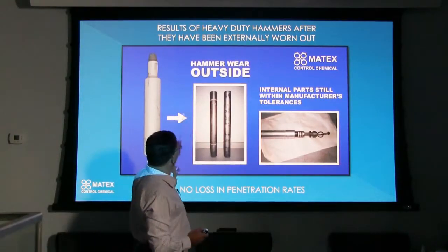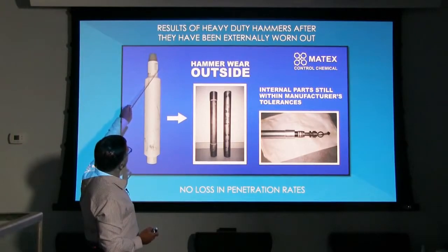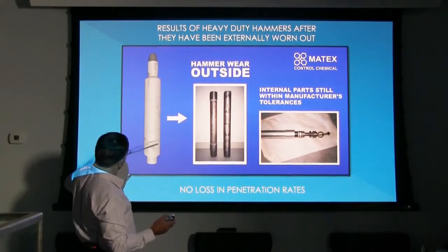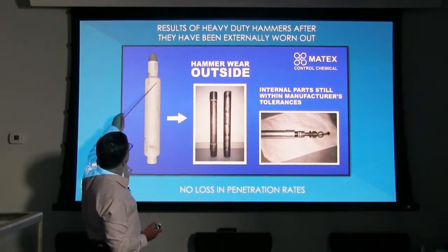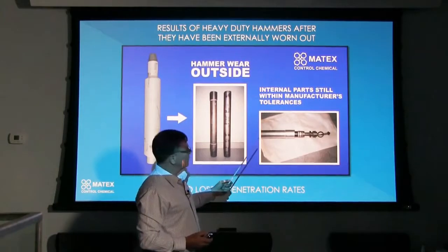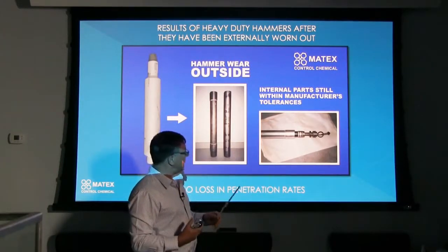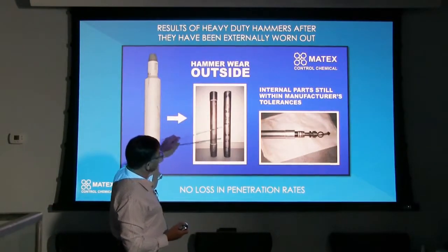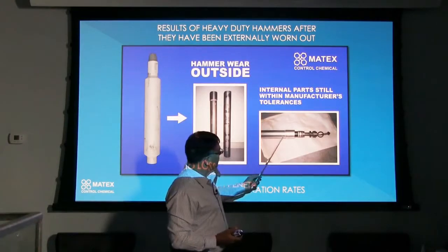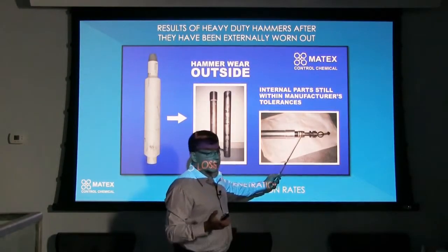This is an interesting story. I had sold 14 4-inch hammers about 18 to 20 years ago, back when it was TRW Mission. The SD4HD at that time — only the case was the large heavy duty part; the top sub and the driver sub weren't on the heavy duty side. Anyway, 14 of these hammers were sold on a dam site down at the Old Man River Dam in southern Alberta. Two and a half years later when the job was all over, I went down and picked up a bunch of scrap metal on pallets. This is one — actually two — of the seven hammers brought off that pallet. When I brought them back to the shop, I asked the boys to take them apart and see what they were because I wasn't sure. They didn't look like anything I had sold. Lo and behold, we pulled out these pistons, the internal parts — and there's your piston. This was from a camera taken 18 or 20 years ago.